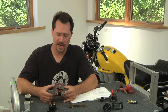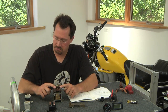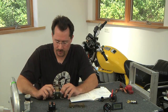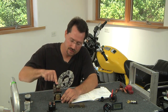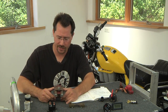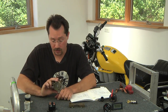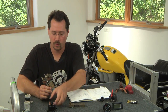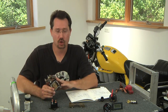This is another style — common on forklifts. It's a very heavy duty contactor with heavy duty power connections, and down here are little signal connections. When you connect power to those, it closes the main contactor, which allows current to flow through. This is actually the contactor I had on the very first version of my electric motorcycle — it worked fine. The only downsides are that it's a bit bulky and it's not sealed up. Since a motorcycle is an on-road vehicle used outdoors, I want to minimize anything that could cause corrosion.